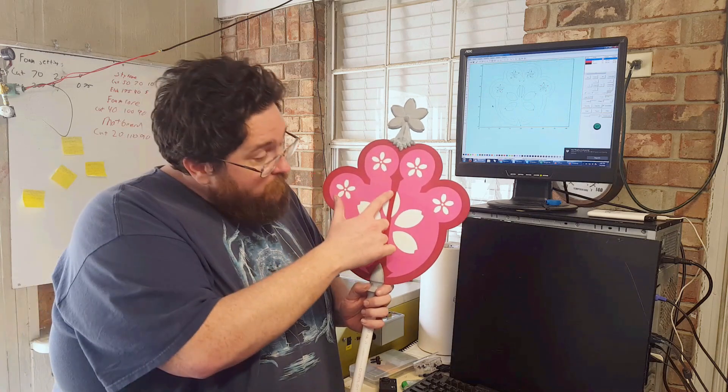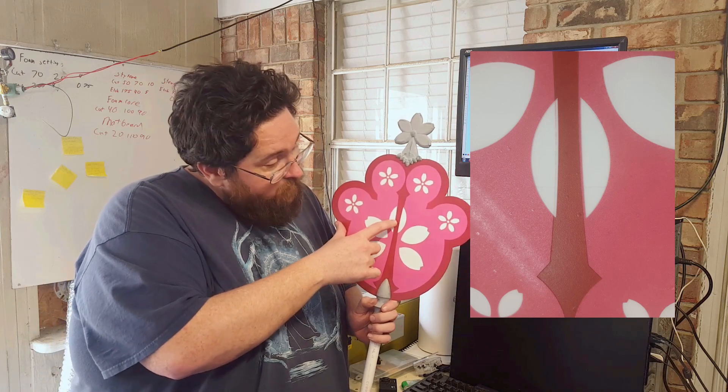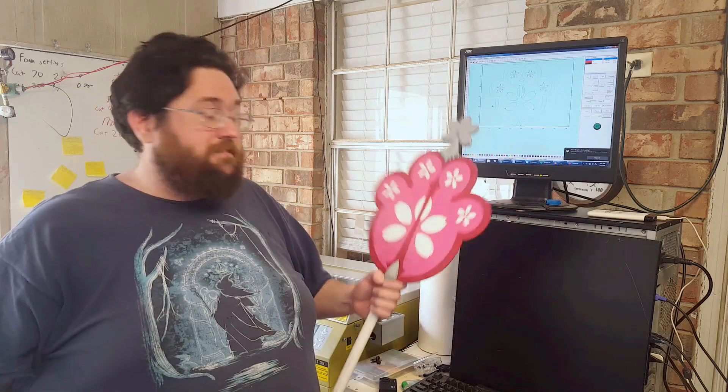The overall thing is that getting the exact placement of these elements here doesn't matter in most spots — if this is off ever so slightly you won't notice. However, right in here you can see there's just a little bit of paint gap where we cut into that red a little bit, and that's part of the problem with doing this kind of stuff. We could try doing a waste board — take some MDF, screw it to the honeycomb, then cut it and experiment. My laser kerf is somewhere around 0.13, but it depends on the material. You'd cut it until it was almost a press fit, cut the outline, remove the centerpiece, then re-insert the piece. I thought I could get it in pretty close since it came out clean — and we did, but it wasn't perfect.